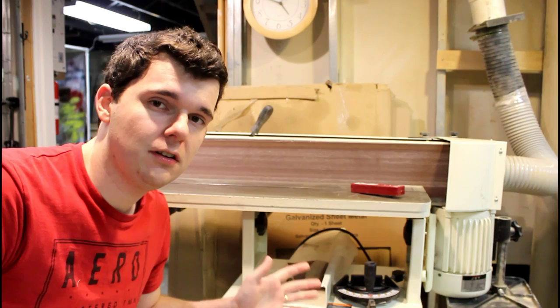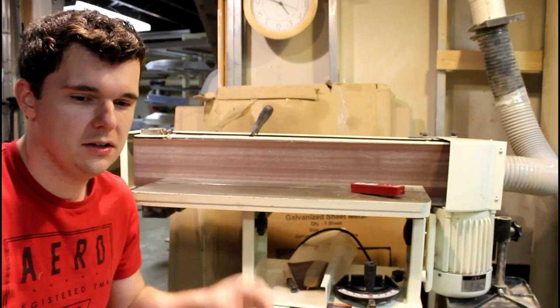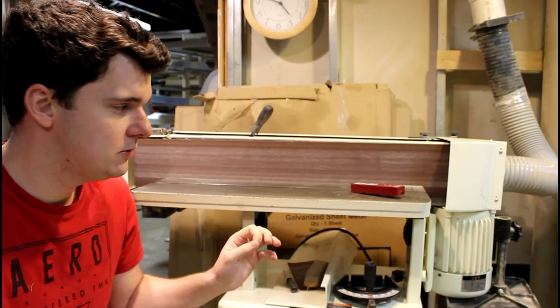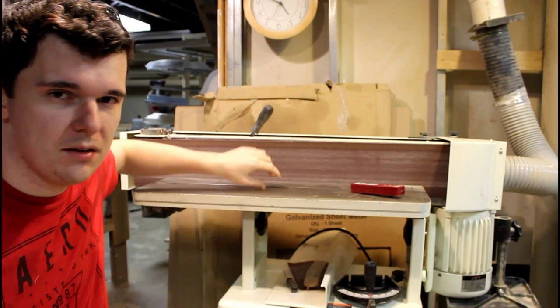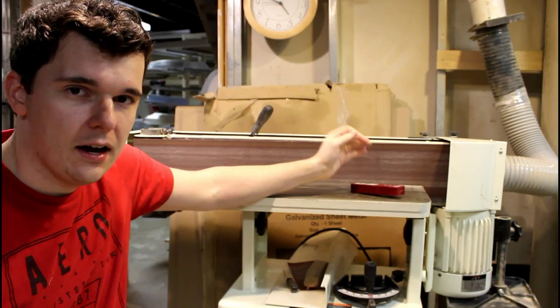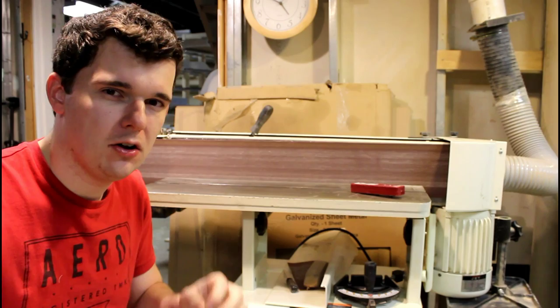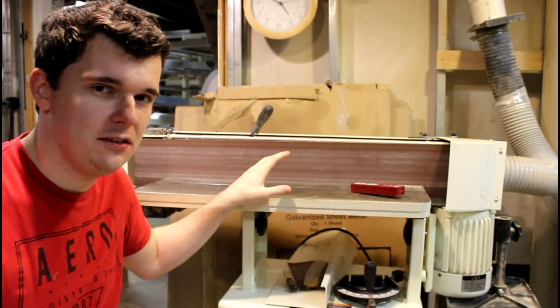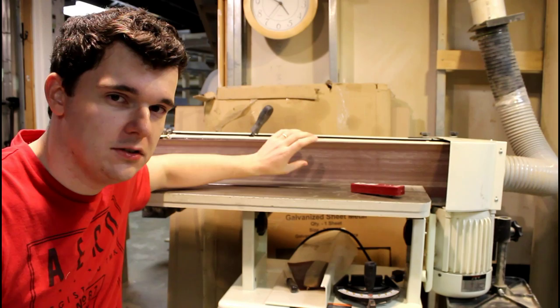When I was initially looking for this machine I had a few prerequisites before purchasing. First, that it was a stout, very heavy and heavy-duty machine to absorb the vibrations it creates — this machine is approximately 270 pounds. Second, I was looking for a large table; if you want to sand large doors or larger work pieces this really makes your life a lot easier. Third, I wanted a spindle head to be able to sand inside radiuses on work pieces — not all machines have this feature. Another feature I wanted was oscillating, meaning the belt tracks up and down in a random pattern, which allows you to wear the belt evenly and not wear in certain places.